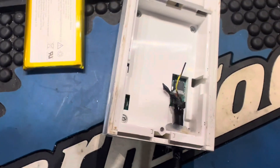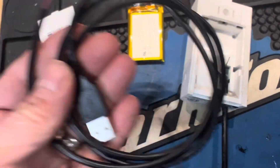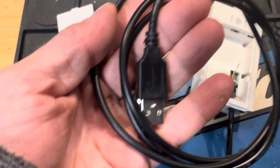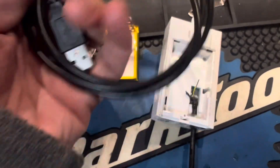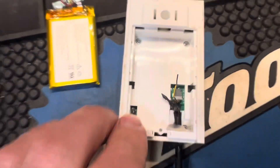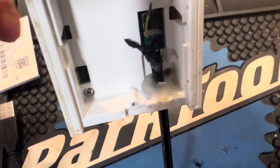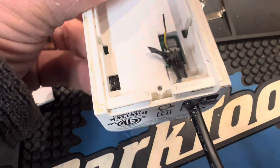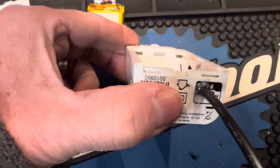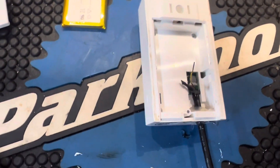So what I did — if you can see down in there, there's a little white plug that used to be connected on the other end of that battery. I just cut off those wires and take the red and the black, and I bought one of these pigtail USB cables with two wire out off Amazon. I cut it down to about four or five inches of cable, then soldered onto that connector, plugged it in, then drilled a hole through the bottom of the housing itself and ran the cable through, sealed it up with a little bit of hot glue on both sides.